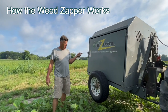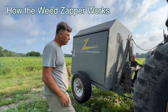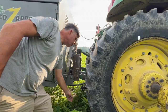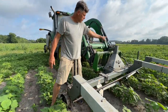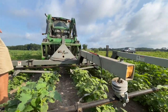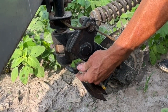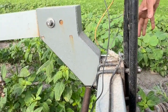This is the weed zapper generator, which is a 120,000 watt generator. It's run by the power takeoff on the tractor, and we have the wire going to the control box in the cab. There's a touch screen control box and a safety seat pad — if you get off the seat, it'll shut down. This is the wire going under the tractor up to the toolbar, where the electric comes through to a copper pipe. I run a 20-foot copper pipe with insulators, and that's what kills the weeds — you want it just barely over the soybeans, touching the weeds. This is the no-till coulter with a speed sensor on it, and there's a grounding wire bolted from the coulter assembly to the pipe, which is bolted to the machine and back to the generator.